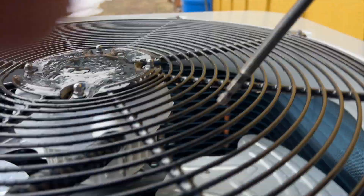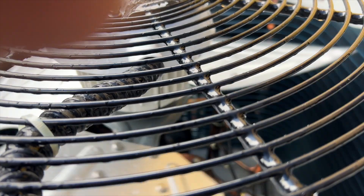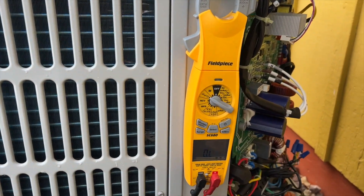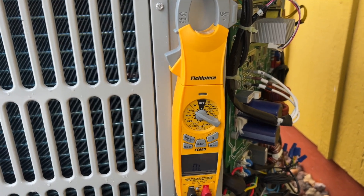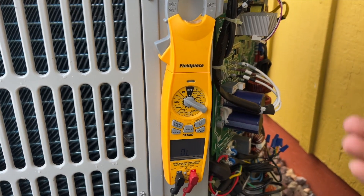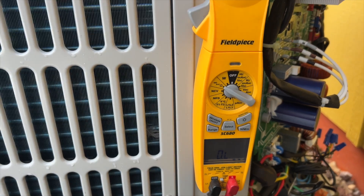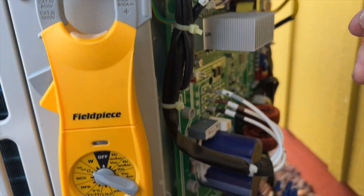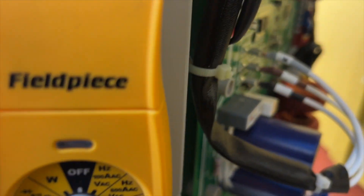Maybe it's bound up. So we'll see if we can spin it. Here's my special spinning tool — yeah, it feels so smooth. So maybe the motor just failed. Another thing it could have been is it could have iced up, tried to spin, detected the fault and cut itself off — that's a possibility — and then it's just been locked out ever since. Now that we've got this reset, we'll put it all back together and try again.